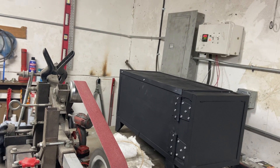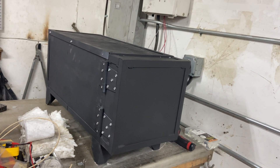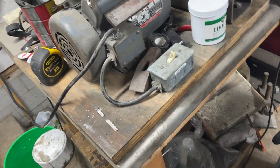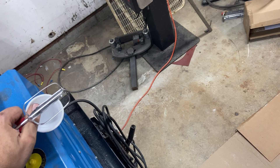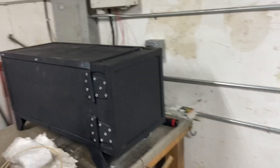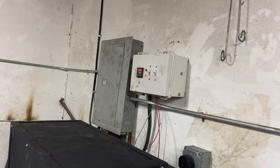I would recommend — and they don't explicitly state this — using clean water. I don't know what kind of contaminants or minerals might be in tap water or if that would affect anything, probably not, especially once you bake it out. But I used distilled water to mix it and it worked just fine. I actually used a little drill attachment to mix it and measured out the water with a quarter-cup scoop — pretty simple, just took a morning to mix it up, paint it on, let it dry, and then let the oven do its thing for a few hours before bringing it up to set point. I can safely say now I am ready for heat treating. I'm hoping to get some knife blanks cut out here pretty soon and start putting this thing to the test.